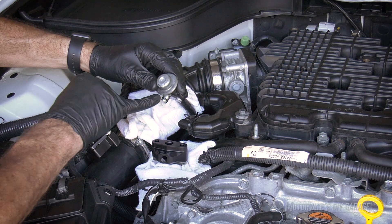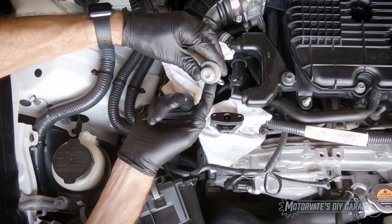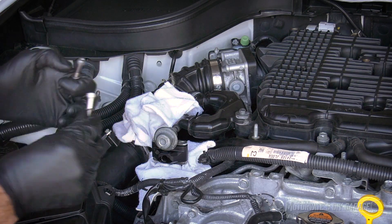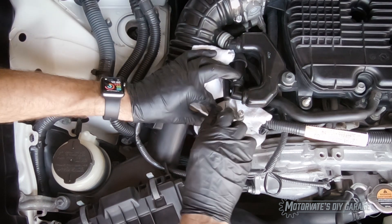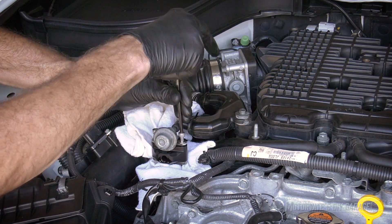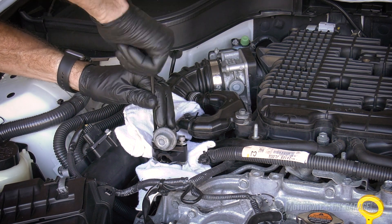We'll now put this like this and push down. Now, we also have an O-ring here, so we're going to take some of this grease and put it on that O-ring as well. We're going to push this down too. The kit comes with some nice stainless steel hardware — we'll put one here and one here. We're going to take a 5mm Allen and get everything aligned. We've got the first one started, then we'll get the second one started.